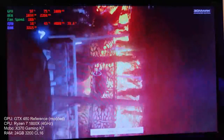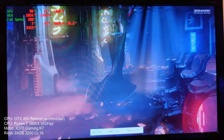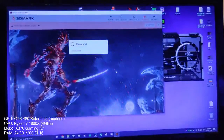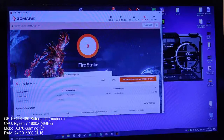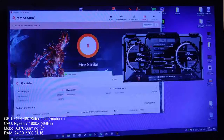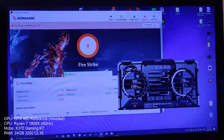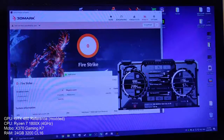But yeah, like whenever I feel like rambling about something and I don't really have anything to show, and the card just crashed because it was 77 degrees. Yeah, that's why I don't want to use the 8X slot. It would have passed in the other one. And maybe it helps if we just set the fan to 100% manually, but I did see it was at 100. Yeah, and it's not gonna, it's actually, let's test.